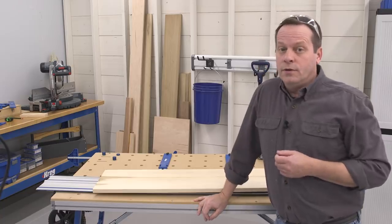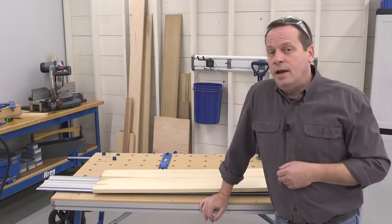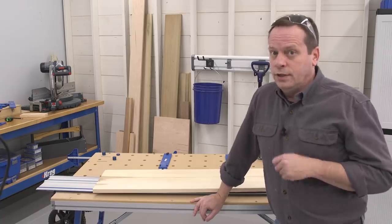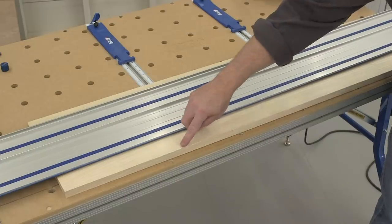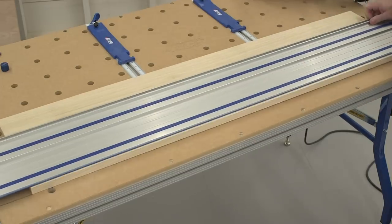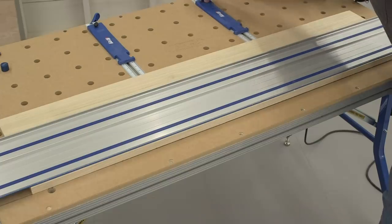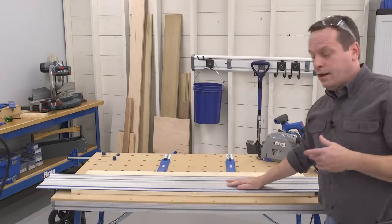A lot of project plans call for boards that are in standard dimensional sizes like 1 by 2, 1 by 4, etc., but finding all the boards you need for your project can be challenging and the cost can add up. With the Adaptive Cutting System you can make your own dimensional boards by starting with a wider board and ripping it down into the narrower widths that you need. A lot of times boards from the home center get banged around, so the edges get beat up and dented, so the first thing I like to do is trim off just a little of that edge. Place the board under the track so just a little bit of the edge is sticking out — you don't have to be exact. I've got a VersaStop under that end to stop it from moving and I'll bring in the repetitive stops just for some extra support.